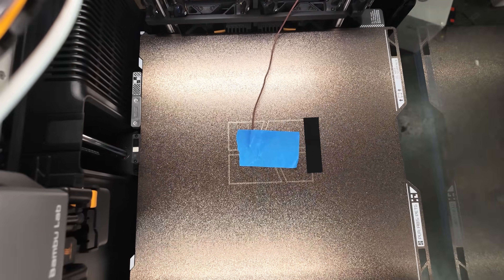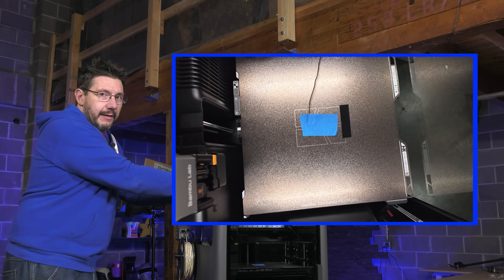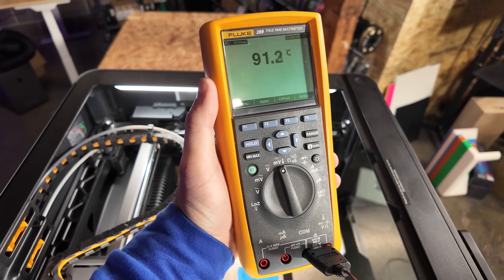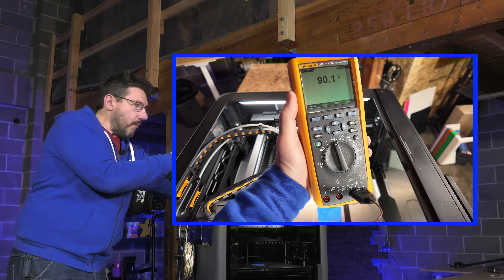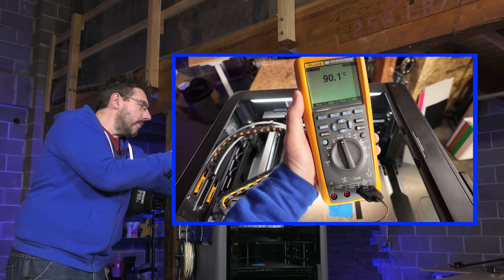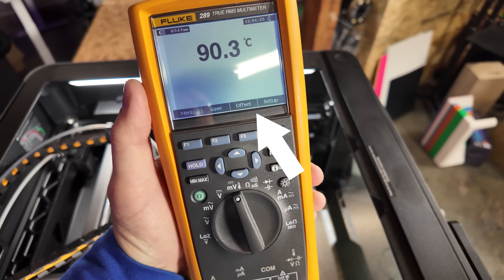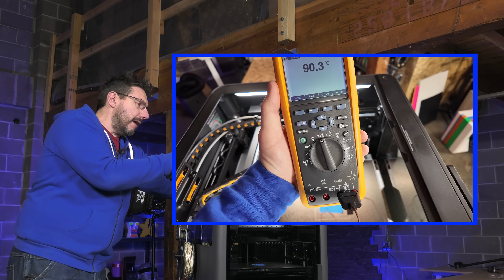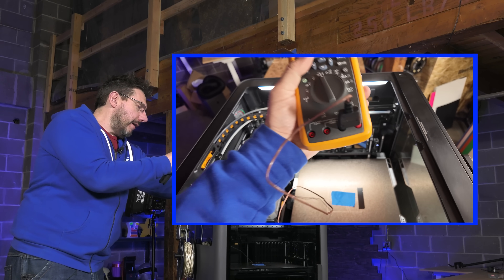You can look inside the bed and see a blue piece of tape holding the thermocouple from the Fluke 289 meter, and next to that is an unstretched piece of black electrical tape. This has been on the bed for an hour and a half at 100°C. The thermocouple has stabilized at 91.90°C — my guess is this reading is incorrect because a thermocouple, just like any instrument, has to be calibrated. There is something called offset — if it's not reading the correct temperature, you can calibrate and set that offset. So the thermocouple, unfortunately, isn't providing an accurate measurement of what the bed temperature is. We can power that down and remove that from the equation.